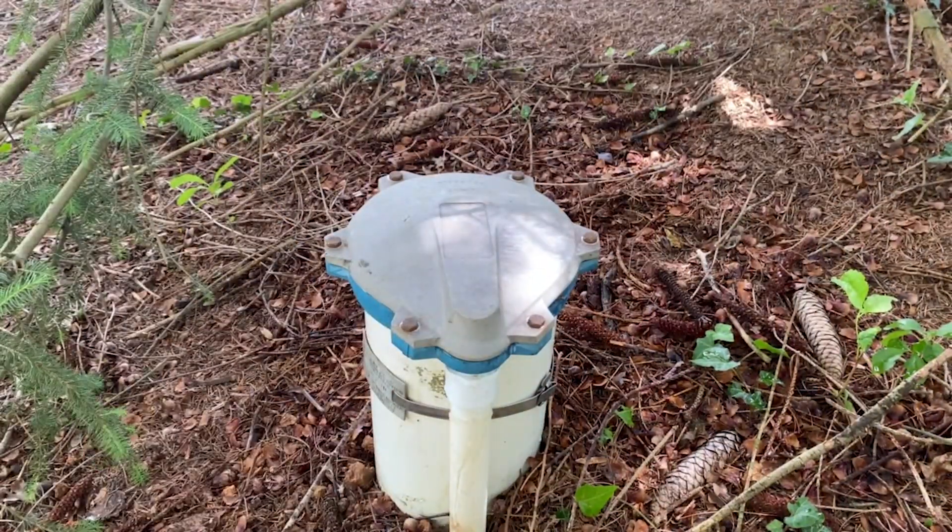Alright, we got done dealing with all of that ant situation on that pressure tank — that was quite a lot of ants; I haven't had that in quite a while. Usually when that happens it's because you're next to a tree or some kind of large plant. This one was directly underneath a large pine tree, so there's not really much you could have done to avoid the whole ant situation. Hopefully with the nice new sealed conduit and a new gasket on that cap, the bugs aren't going to want to get inside anymore.